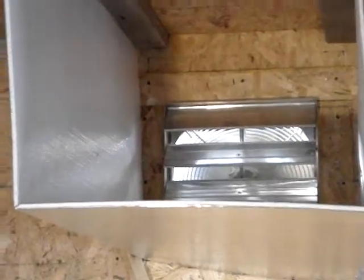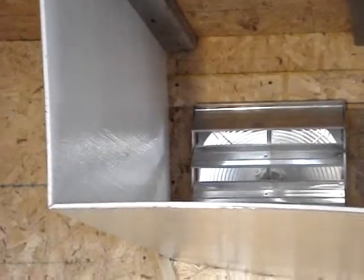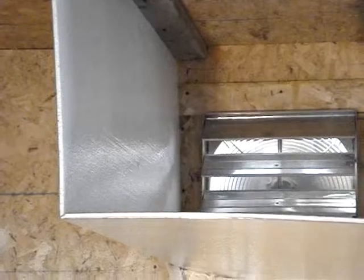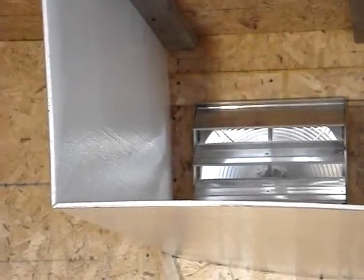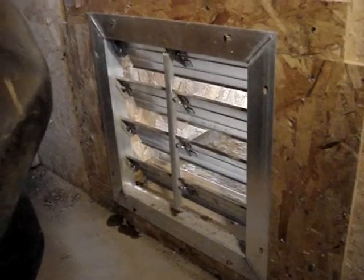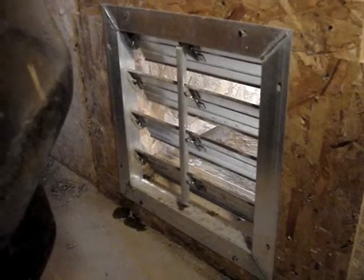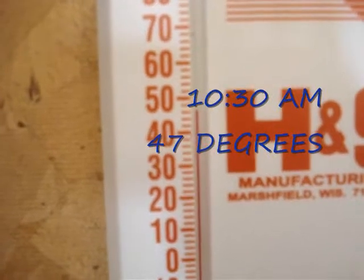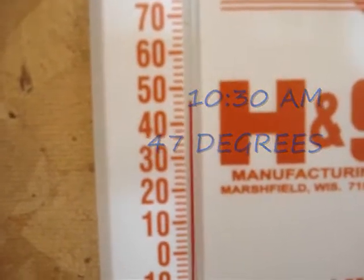The panel is starting to get warmed up and will probably stay on. We're running a 16-inch barn fan with automatic louvers, controlled by a thermostat that's between the fan and the panel. This is the lower intake air vent — just a set of louvers like on a fan that automatically opens. With the fan running intermittently for about 15 minutes, it raised the shop temperature one degree.